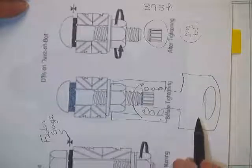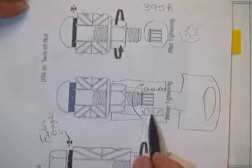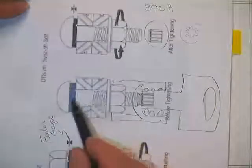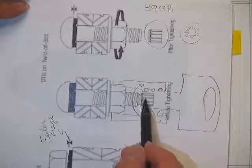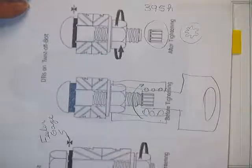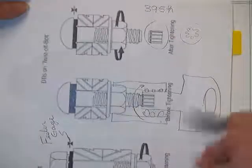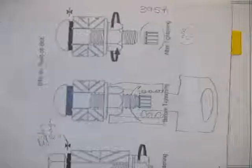And outside here, you have a motor connected to this, and the motor rolls the nut in this direction. These are bearings. And when the motor is so powerful that this thing is driven up and there's so much tension in the bolt, this thing breaks. And that's a carefully controlled dimension right across here. And the minute it breaks, this little machine, this wrench, it quits because it knows that it stopped, because otherwise it'd do you like an alligator. It would roll your arm off.